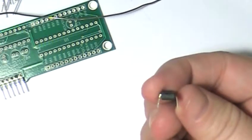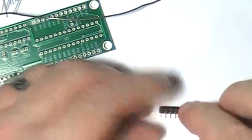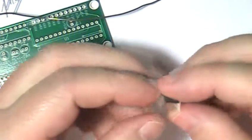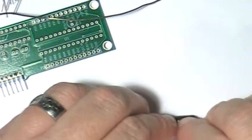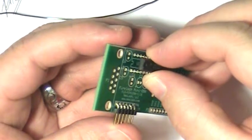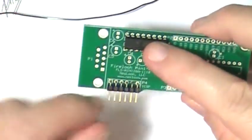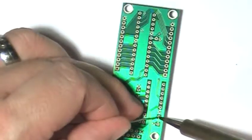As with all new IC chips, the leads are bent out at a slight angle to aid in automated part placement. So the leads need to be bent in slightly to permit placement of the IC on the PC board. To do this, lay the IC on its side like this and then gently apply pressure to roll the IC in the direction of the pins so that the pins are bent slightly, straightening them. Be sure to be very cautious during this stage. If you apply too much pressure, the IC can snap forward and bend the leads far too much. Now, do the same thing with the other side to straighten the pins on that side, and then insert the IC into the circuit board. And make sure the notch on the IC is on the same side as the RS232 connector.